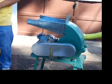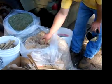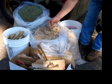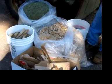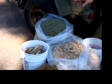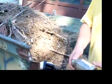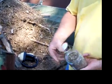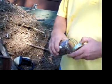Here is an example of cardboard that has been run through this hammer mill — it turns it into like a cellulose material. Very nice and dry, could be added with some wet material to make good pellets. We have grass, corn cobs, but today we're going to take this pine material. When we run it through the hammer mill it'll turn into this consistency, and then after we do that we'll run it through the pelletizer and actually make pellets.